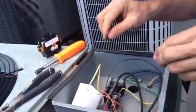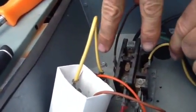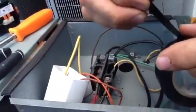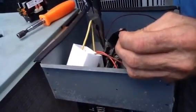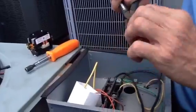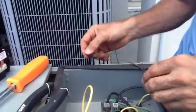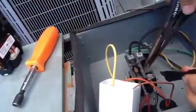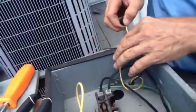What I want to point out — the reason I did that — right now the coil is energizing this existing contactor, so that means we have 24 volts on this coil. In order not to blow the transformer or the fuse that's in the air handler downstairs, I'm just going to take a precautionary method — I'm going to pull this up and put a little piece of tape on here, just to make sure we don't short circuit the transformer. 24 volts you don't have to worry about getting a shock, but I've advised you not to touch it anyway.